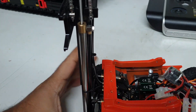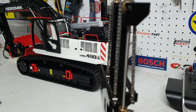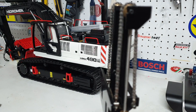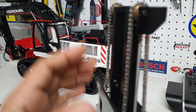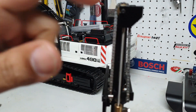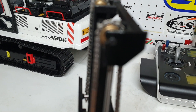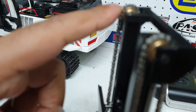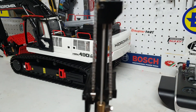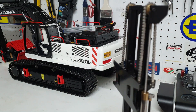Talking about the boom, I don't know if you can see the detail on the chain because it's hard to get focus, it's so small. But all I want to share with you here is there are two pulleys on the top. There are no sprockets on the pulleys, just simple pulleys. And then you've got this load-bearing chain that actually pulls the entire forks up and down.